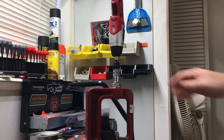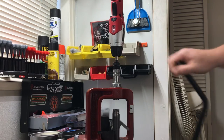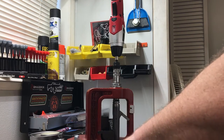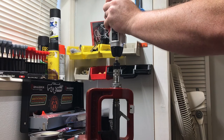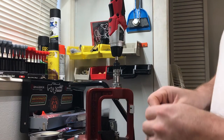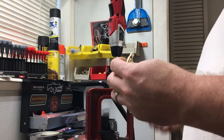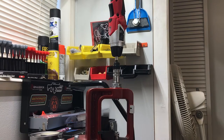One little thing I want to add about this quick trim die: pretty much all I do is raise the ram and then drop this die down until it touches the bottom. That way I know that every time I raise this piece of brass up it's always going to be the same size. I don't over-cam it or anything like that — I just bring it up so it's consistent. When I bring this down on top of that piece of brass it's going to cut, chamfer, and deburr. I always put a little tray right here to catch everything, then double-check the inside. It's easy to set up — almost like a sizing die.